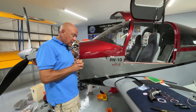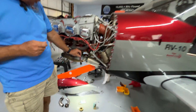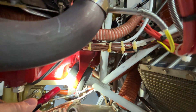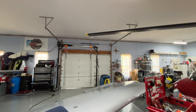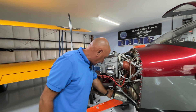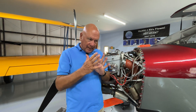One thing I did notice is I feel a little bit of vibration in the mixture lever that was never there, and I've been trying to chase that down. I've noticed we've got a leaking motor mount — these are silicone-filled motor mounts. You can see the leak there and there's a little bit of a gap, so I'm thinking that's what's causing the vibration. To change those, I'm going to get an A-frame, move it around to the front, and kind of pull up the engine from the bottom. I will be disconnecting the exhaust system — we don't want to put any stress on components while lifting the engine. It's a little bit of work, but just break it down into individual things and you'll find that you can do this too. It'll stop the oil leaks, and your engine will idle and start much better if you pay attention to those intake gaskets.